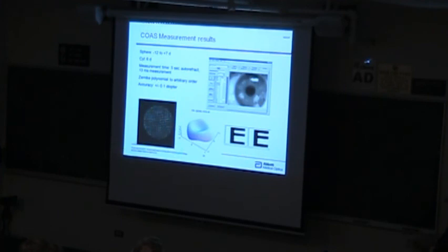Here are your focal spots. Of course, you can compute the wavefront from that. We very typically will present that in terms of Zernike polynomials, although we will also show the zonal maps as well. It's sometimes useful to have an eye image so that you can do a correlation of some sort, and you can register that eye image to the wavefront map. The wavefront's just over the pupil, but now I can take that information and put it on another machine and register that to that same eye. And that other machine might be the laser that does LASIK. That's actually, in fact, one of the most common applications.